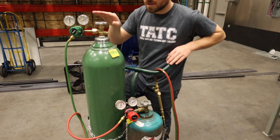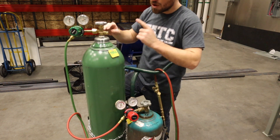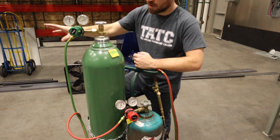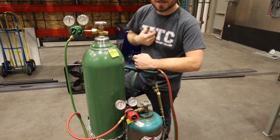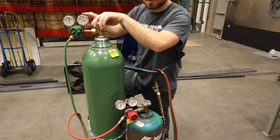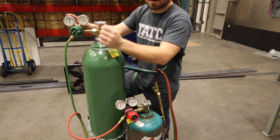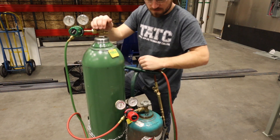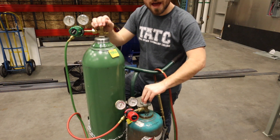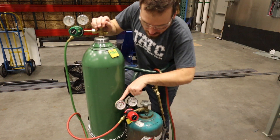After the visual inspection, we're going to turn on our valves. The first is the oxygen valve — it's a double-seat valve, so we want it either all the way on or all the way off at all times. Notice I'm standing to the back of the valve; if something goes wrong, any explosion will go forward rather than into me. I'll crack this valve open — you should see pressure on the tank-side gauge, which tells you what's inside the tank. The working pressure gauge, which reads what's going out to the torch, will show zero until we adjust the regulators. Open the oxygen all the way, then crack the acetylene valve only until it shows up on the gauge — no more than a turn and a half.